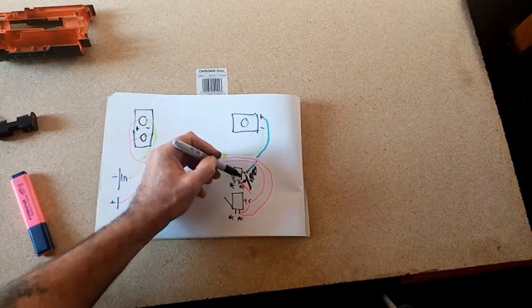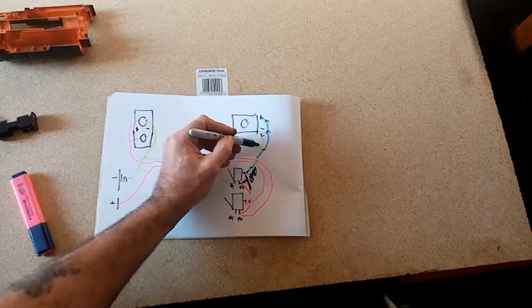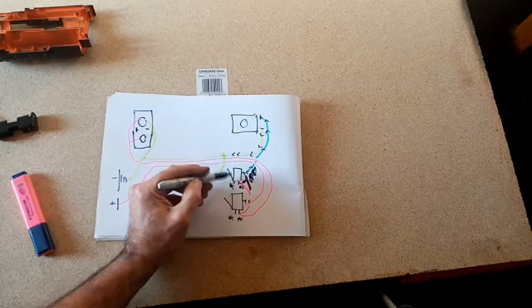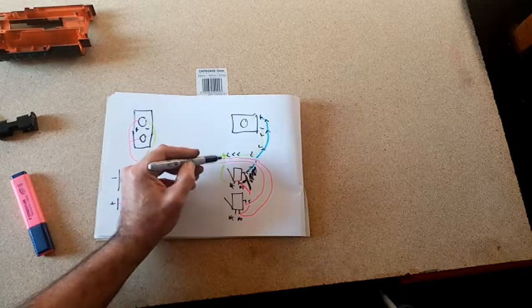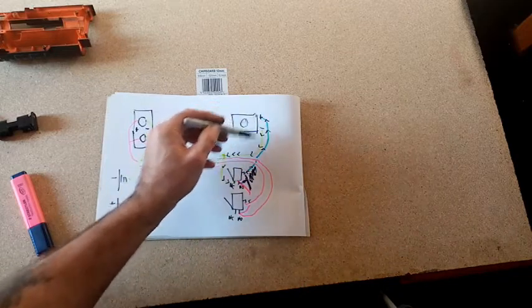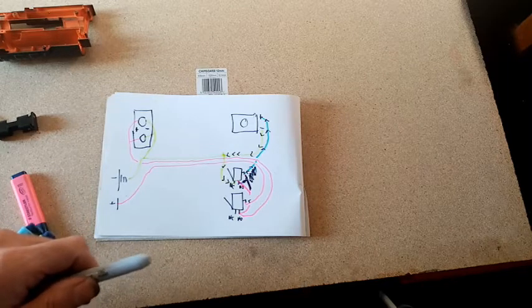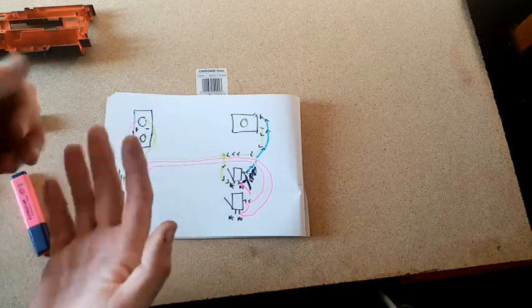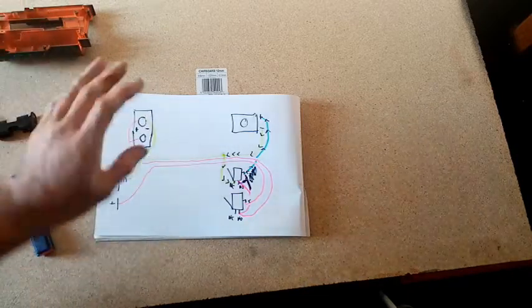Up there, up there, out. And as soon as you release this, you make a path from this connection here to the normally closed position of the switch, and the current goes around like this. And that stops the motor almost instantaneously, which is what generally happens with the electromechanical locks in blasters that we all remove. You know, your jam door lock. You open your jam door, you apply motor braking to the flywheels. Or the rest of the circuit in this case.